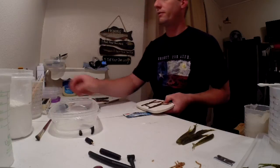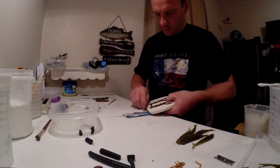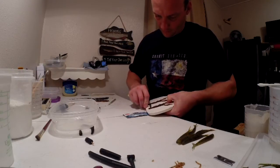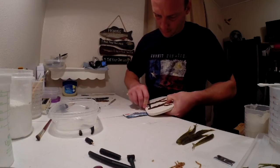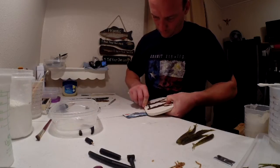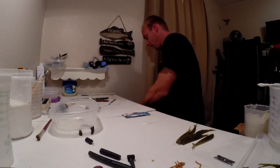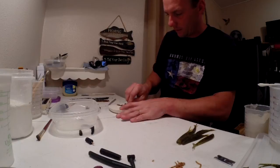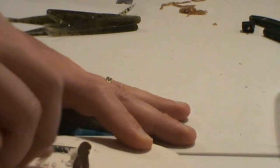So I'm going to carve off some of this around this sprue hole just so it's fairly flat. Whatever I carve out of this, obviously the top mold will fill it in again, so I'll have two fairly flat molds with half of the sprue runner in each one.